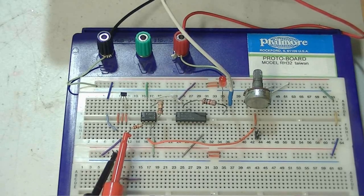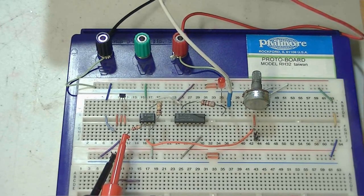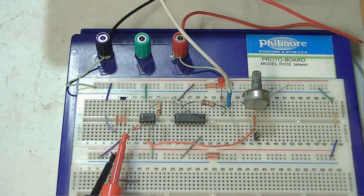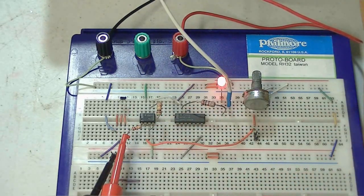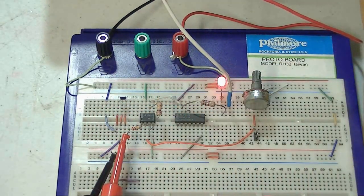What you see before you is a comparator circuit constructed from a 741 op-amp and it is tied into this ratiometric Hall effect sensor. I've also constructed another type of Hall latch. South pole of the magnet on the Hall sensor — the LED comes on and stays on. North pole turns it off. South pole on the face turns it on, north pole on the face turns it off.